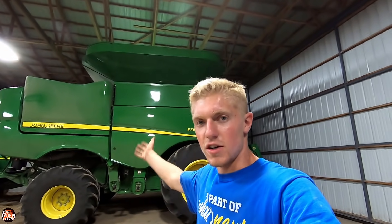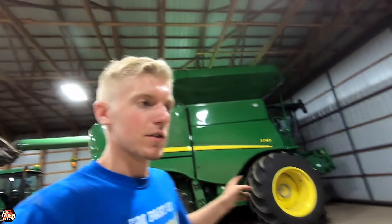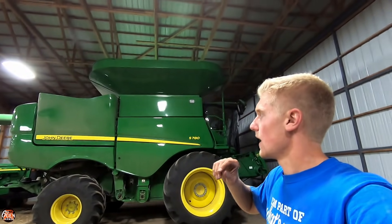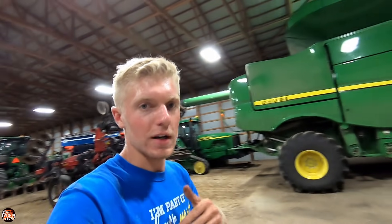We planted using Climate Field View, and now I want to combine using both John Deere Operations Center and Climate Field View. The beautiful thing about Climate Field View is that when you plant your fields — lots of times we'll plant half a field with one variety of corn, half with another — when you go to combine, it automatically picks up what variety you planted there and shows it on the monitor so you don't have to do anything. John Deere can do the same thing, but you need to create what's called a variety locator file. Because we didn't plant with JD Operations Center, it's a little more difficult — I have to create the file on the computer, select all the fields with what's on them, send it wirelessly to the combine, accept it, download it on, and make sure everything looks good. That way both Climate Field View and JD Operations Center are recording what variety we're combining.